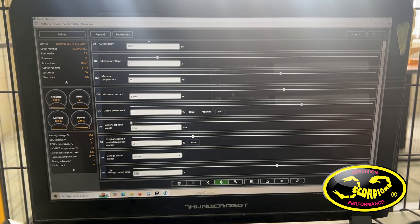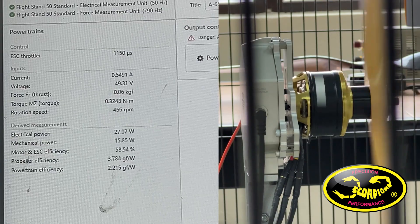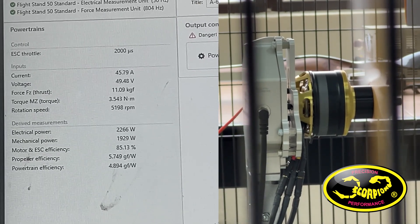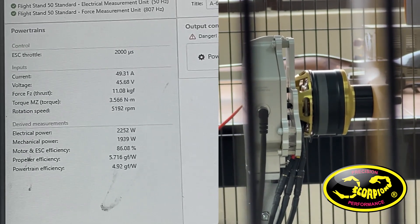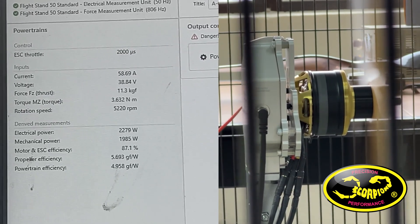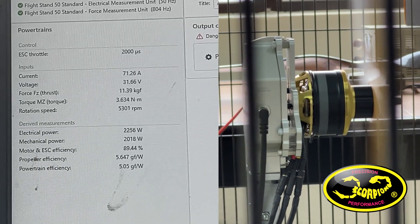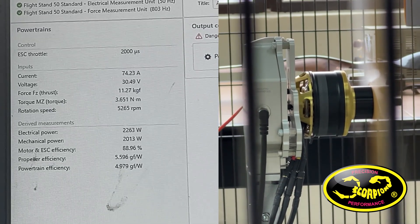To further demonstrate this, I will lower the voltage output down to 30V. Now I will do a test run and manually adjust the voltage on my power supply. I am starting at 50V, but it is only sending 30V to the motor. You can see the RPM is around 5200+ and the thrust is around 11.2+. As I lower the voltage, you will see that the thrust remains about the same, and the RPM as well remains about the same. Now, my limit is set at 30V, so of course if the battery voltage goes below 30V, the RPM will begin to drop and the thrust will go down. But once I get back above 30V, everything will recover.